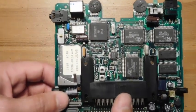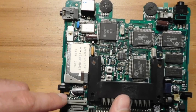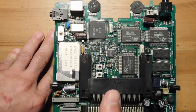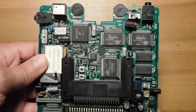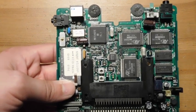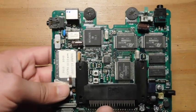It's not only important to replace aging capacitors with modern ones on retro consoles, but also to make sure you use quality parts. Panasonic is a good brand; Nichicon is an excellent brand — that's what I use for most of my replacements. If you use generic manufacturers, then you're probably just going to have issues. It's just a matter of time before low quality capacitors start to fail, they'll leak electrolytic fluid and cause damage, and then you're just back at square one.